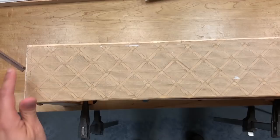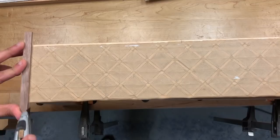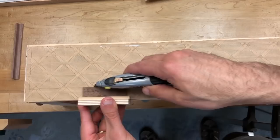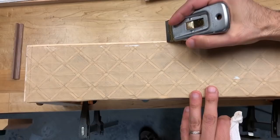After just 5 or 10 minutes, take it out of the clamps because now it's time to true up the edges and the bottom. This is the corner molding that's going to be on the finished product — using that as a guide and a sharp utility knife, you can score through the veneer and then remove the excess on the sides. For the bottom, the idea is the same: I made a little jig out of the bottom molding so I can hold it against the bottom and trim off the excess with the utility knife. Any glue squeeze out, like at the top, you can get with a moistened paper towel. A little scraper or putty knife works well too to get all the glue out before it cures.